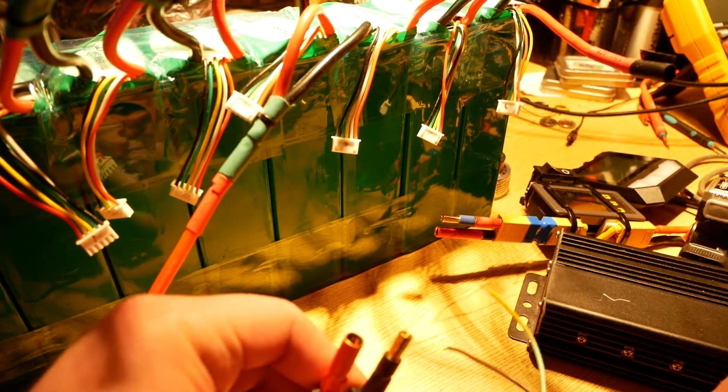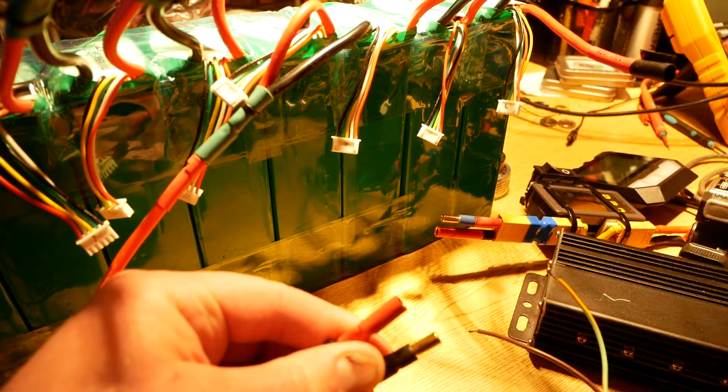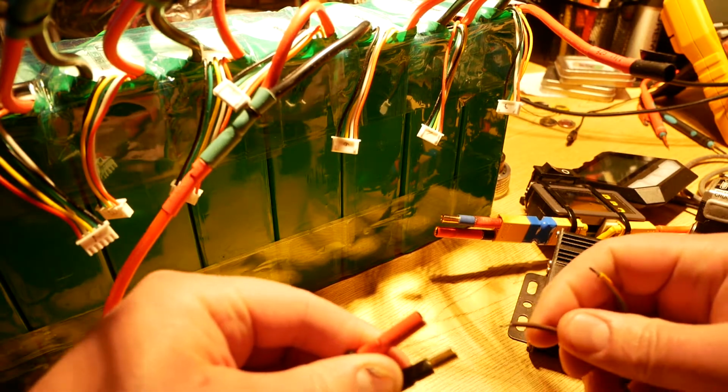The capacitors are unharmed by doing this. It's not them that I'm worried about. It's all the rest of the electronics. That's what gets damaged by all that inrush current. The capacitors will take blasts of current day in and day out, 1,000 times in a row, no damage to them. But everything else, not so much.